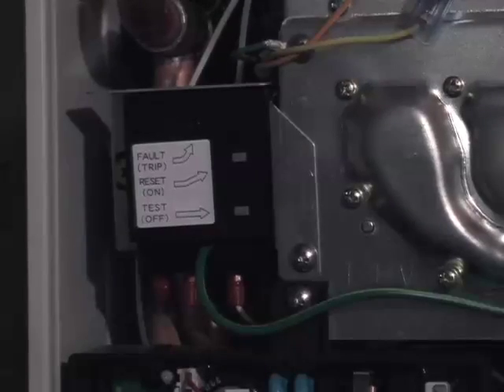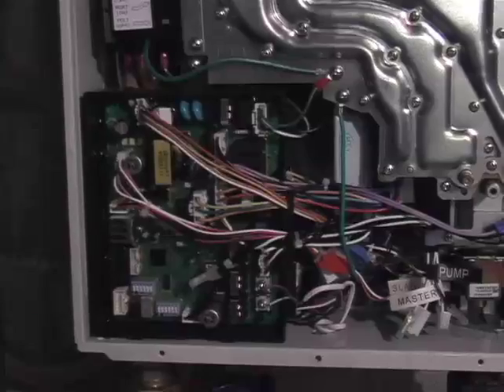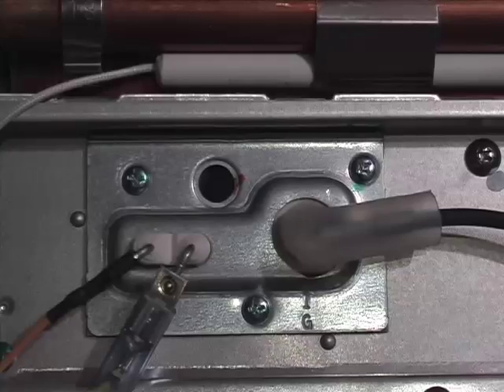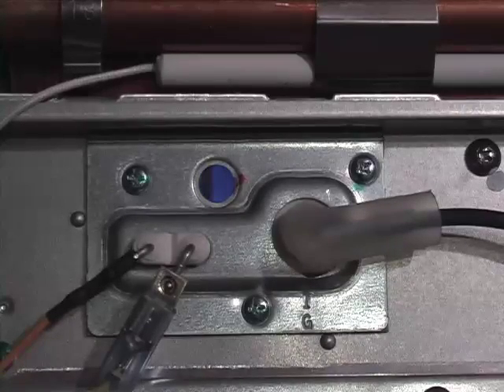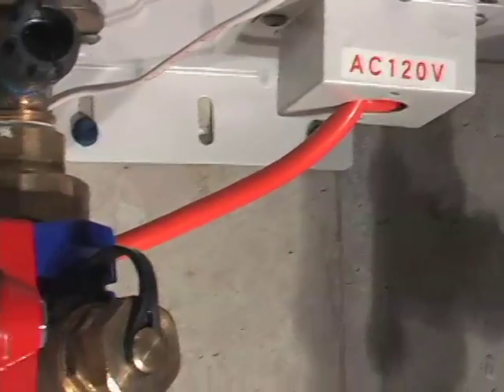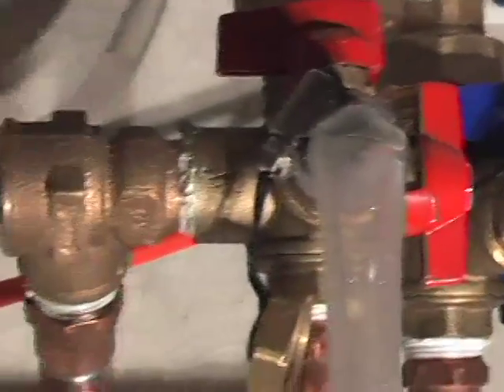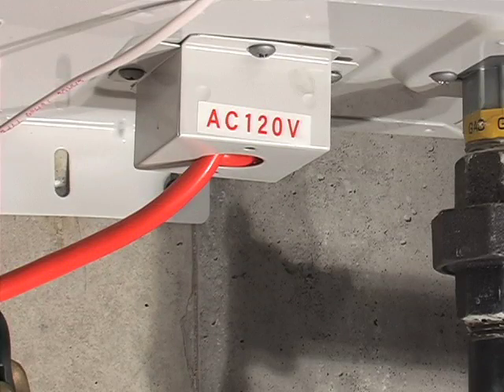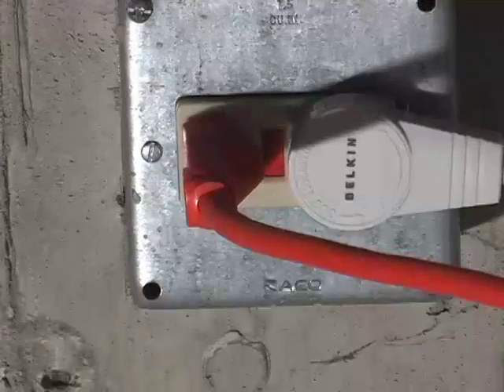The last step is the electrical connection. All gas-fired tankless water heaters require the use of electricity to operate. The electricity is not used to heat the water, but rather to run the controls that operate the unit — for example, the fan, the board, the spark igniter, etc. Most require 120-volt alternating current and run typically at less than half an amp. This is a very minimal draw compared to most appliances. Many manufacturers will include a pigtail or some kind of electrical connection. You can plug the pigtail into the closest wall outlet, as seen here, or if you prefer to run conduit to your tankless water heater, you can do that as well.